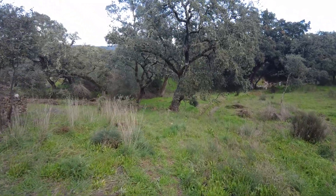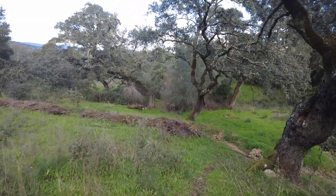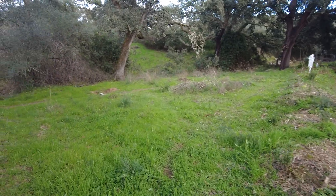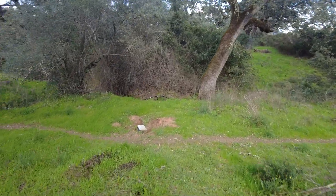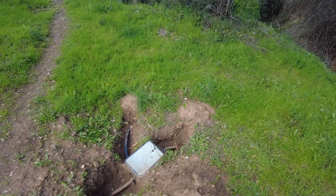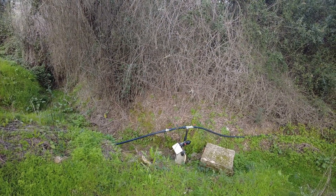The cistern is down in the creek, so the water needs to be pumped up. The cistern is almost full — that is great. I have the ball valves to fit. This is the original system: water from the cistern towards the house and then up to the water tank. It's 32 millimeters, and here I now have 40, so I have an adapter there that will be installed.